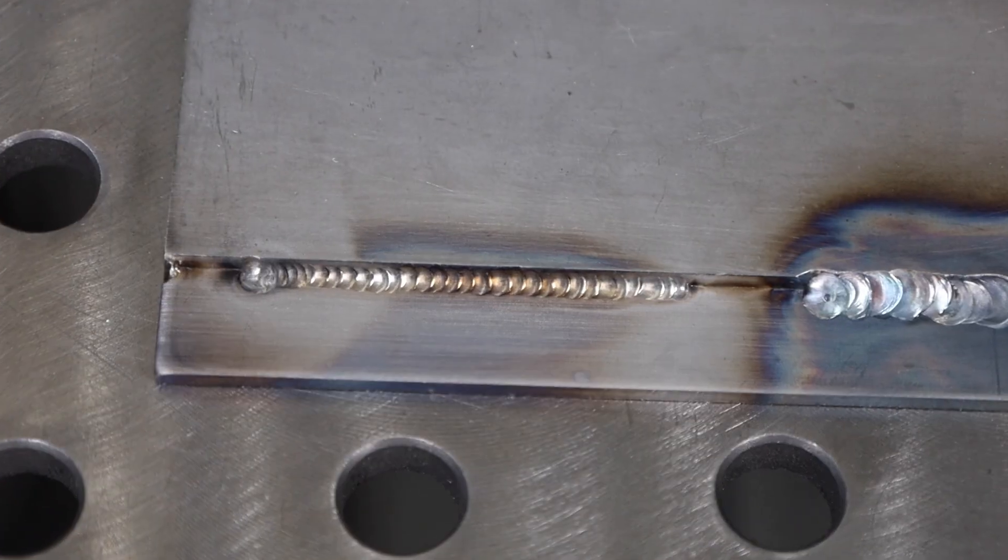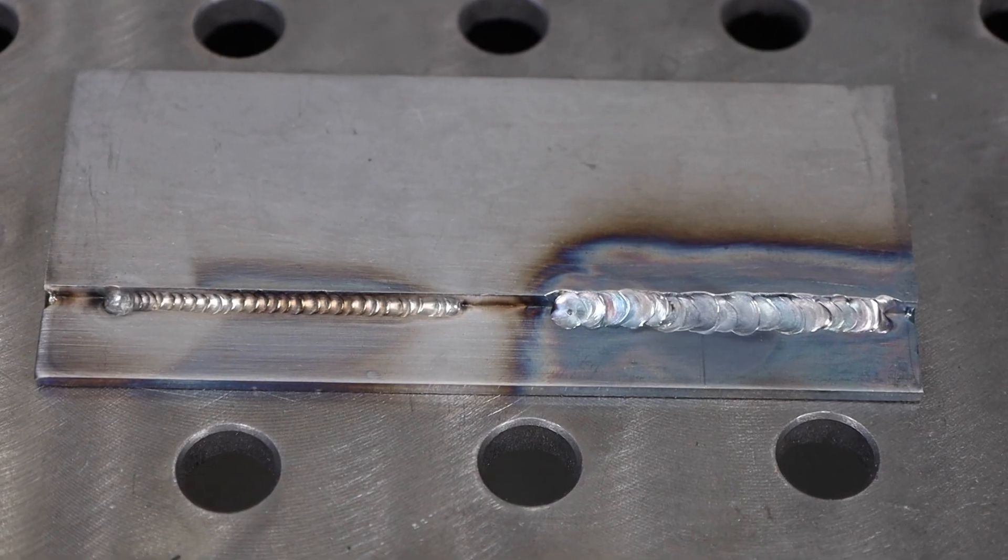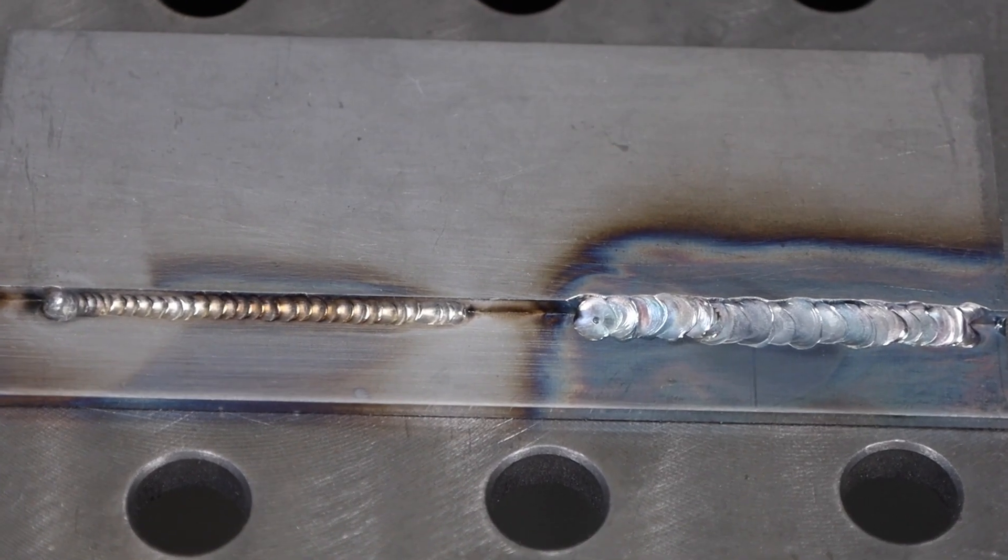So if we look at the difference between these two welds — the one made with the long arc length and the one made with the short — the difference is night and day. Being able to keep a nice short arc length without dipping your tungsten electrode isn't something that's going to come immediately, but it is something to work up to, and I think you'll find that your welding improves dramatically.